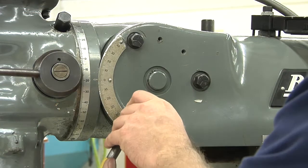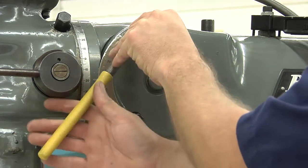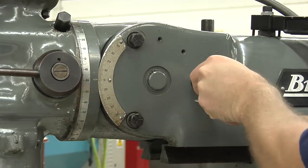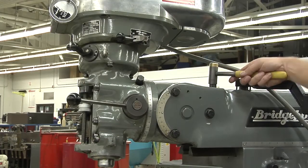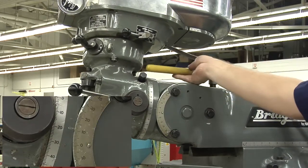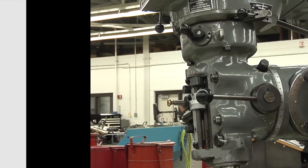The second way you can adjust the head is behind the tool head. Again, begin by loosening the first bolt and then snug it up to prevent the head from falling. Loosen the other two bolts and use the swivel bolt to adjust the head to its desired position. This adjustment doesn't have a safety pin. Snug up all three bolts and then tighten all three bolts.